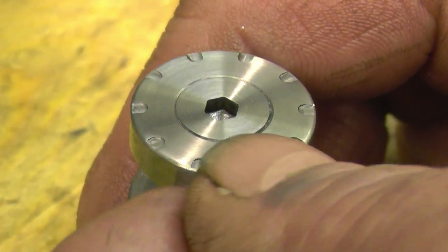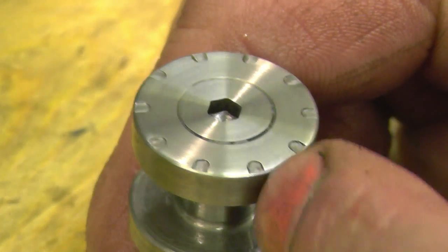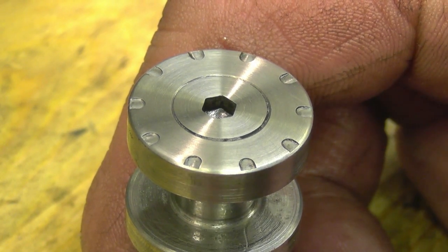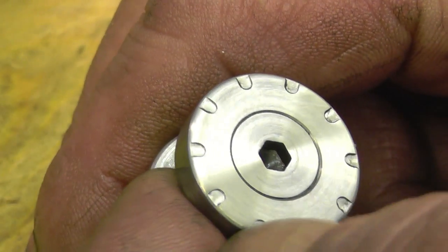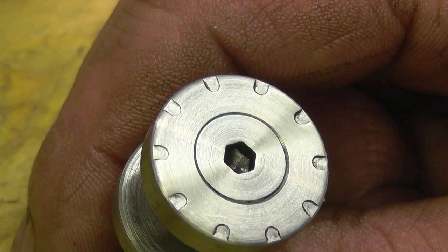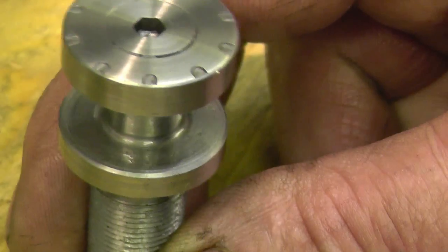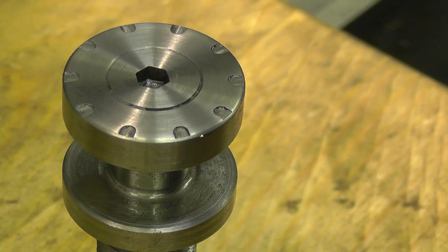Right, that's the finished thing — 10 equally spaced divisions, even I can see them. So that's going to give you 0.1mm movement on each division. Like I say I'll be working in thou anyway so I've got to put a clock gauge on it, but at least you have got some sort of reference point. I've got some smaller cutters; I could have split that again — it might well be worth making an engraving tool so I can do finer divisions. Anyway, put it back together and see how it works.